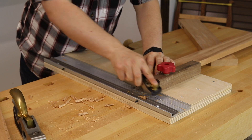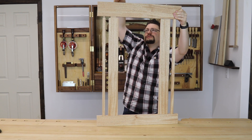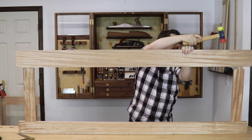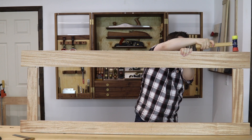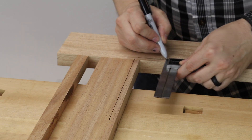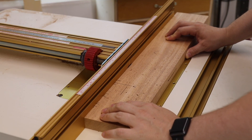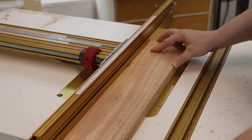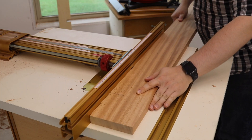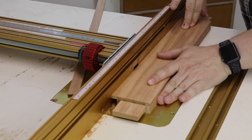On the other side, I slowly brought down the thickness of the tenon so that it would fit, and I got the fit I wanted — almost perfectly parallel with the back. Then I took the frame and the mirror part to draw some lines for the depth of my rabbet and the height of the rabbet as well. Once that was all drawn, I went over to the router and started making my passes. I did this very slowly — first going for the depth, got that nailed, and then started on the height. This way I have one axis done and as I slowly move up I get a really nice crisp cut, which gives me a really nice crisp edge to my rabbet.